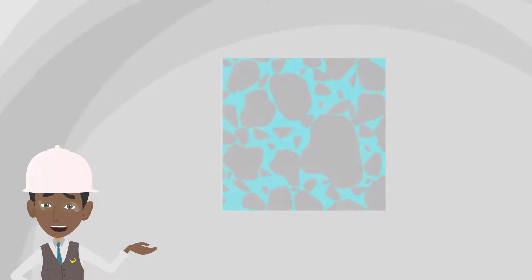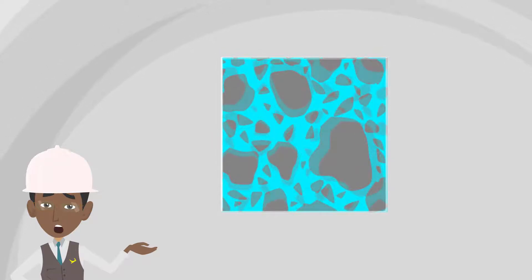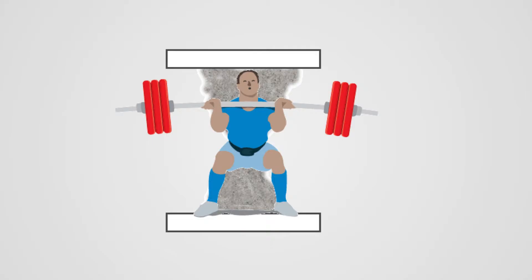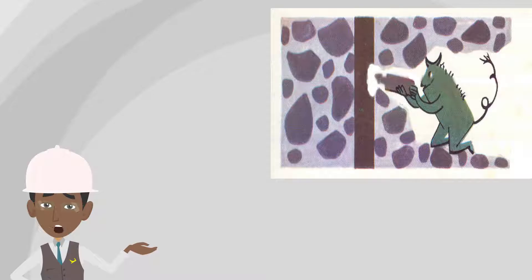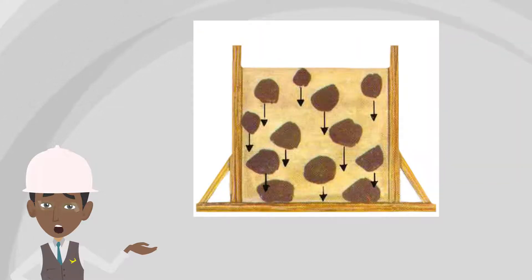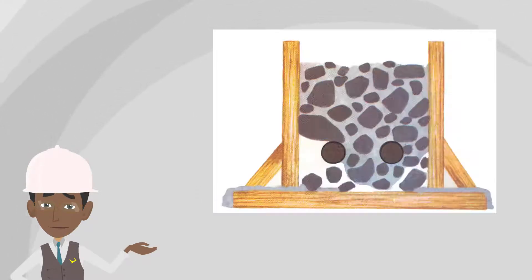Look at what happens to the fresh concrete. By adding water, you are filling the inside with it. And after hardening, the water evaporates and the concrete becomes very porous and therefore less resistant and more vulnerable to external pressure. Thus, it is less sustainable. Also, with an excess of water, the fresh concrete is segregated and easily loses its laitance.